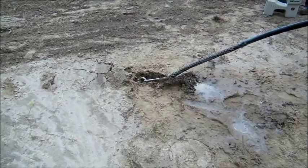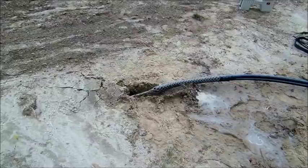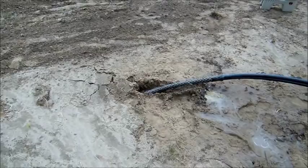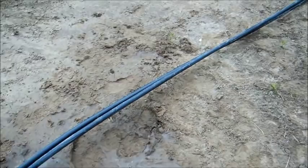Now you can see them starting to pull this thing and the machine is pulling it back under the earth. These have drill rods on the end which are about 20-some feet long. After it gets to the end, it takes one of the drill rods out, puts it back in the rack, and then the machine comes back and regrabs the next pipe and just keeps pulling it back. They'll keep pulling it back until all the tubing is gone and it comes up the other end.